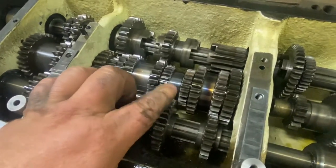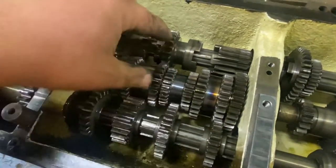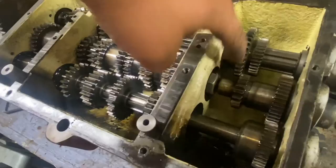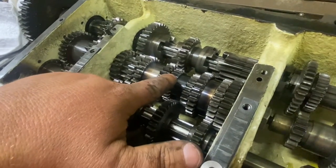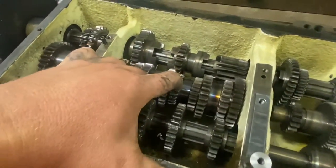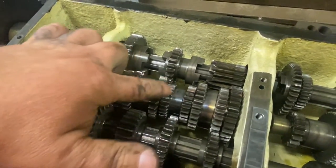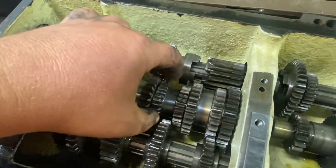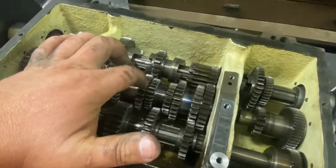Now this upper gear — it doesn't show well on camera, but this bushing is really thick. These parts are all stacked together and clamped with a nut. I'm going to do the same thing there: turn all the threads off and down a bit, press on a gear, turn the gear down past this point, and then pin it — probably two pins, press fit, and put a couple pins through and into the hub. There'll be less meat in it, so that's why the extra pinning.